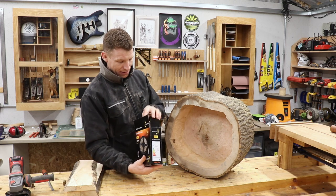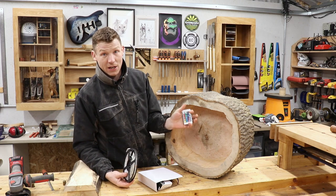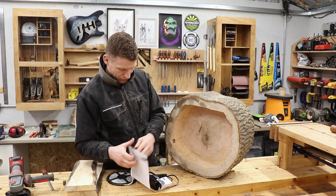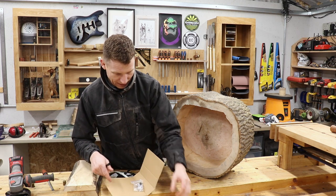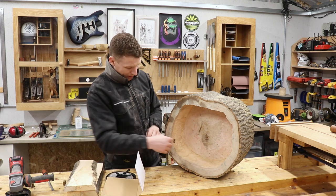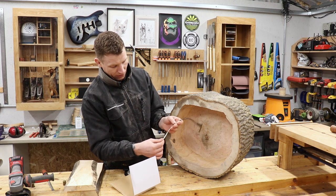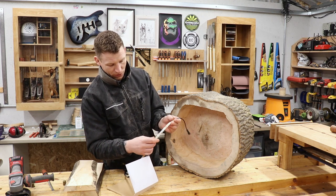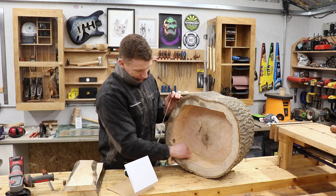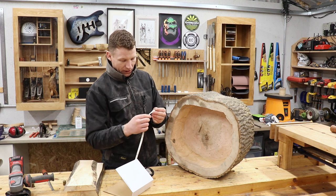The next thing I want to do is fit the LED. I just have an LED kit here — this is an RGB kit, so it comes with a remote and you can change all the various colours. There's our power lead and our driver. So that connects to that — we put a plug on that and we can plug it in. There are various different clips and attachments to screw it in all the way around. So I need to put a recess — I'm going to come in about a third of the way and put a recess all the way around and clip this into it. This is rubberized, so none of the LEDs are exposed — good for indoors and outdoors. It's sticky-back, but I might use a bit of hot glue as well because the tape will eventually lose adhesion and just fall out.